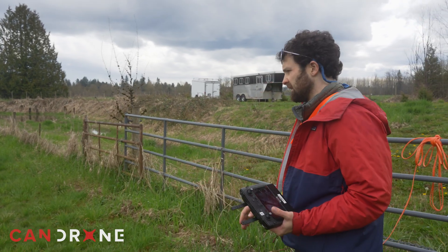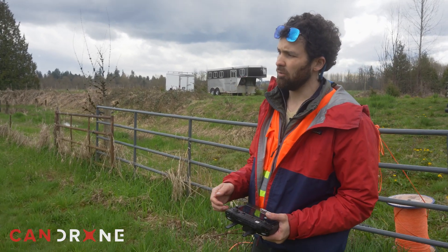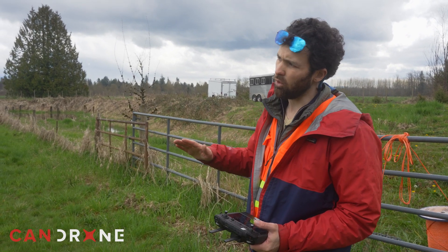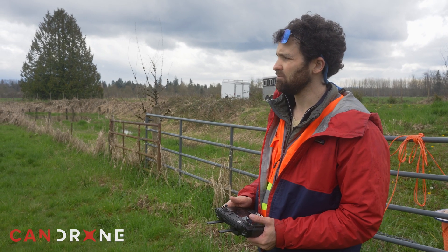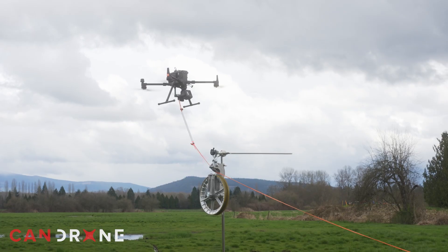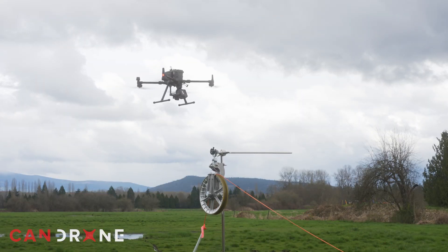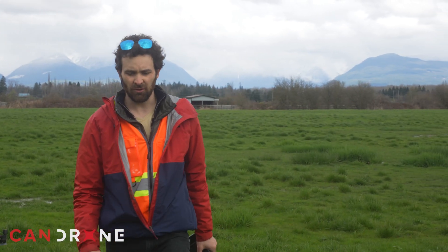I've taken in some slack. That will allow us to get some tension in the line so that when we align with the gate on top of that block, it's a little bit more horizontal angle and we can place it in the block more easily. We found that by tying off our line to the fence there, when you start to get some 30 or even 40 degree slopes, you get the horizontal orientation that matches that horizontally oriented gate.